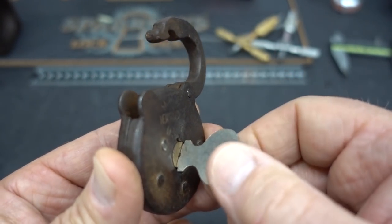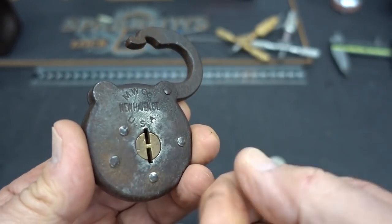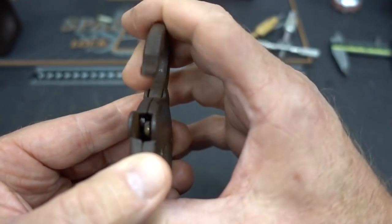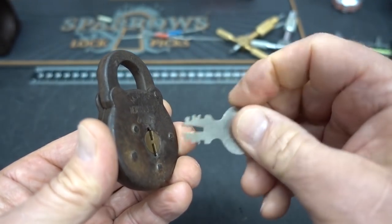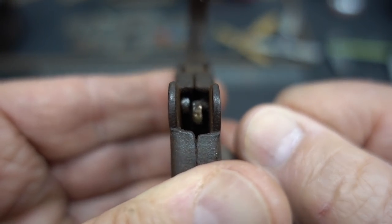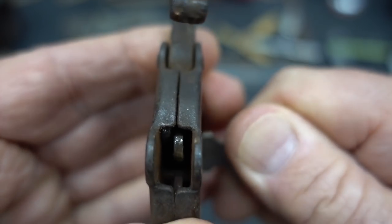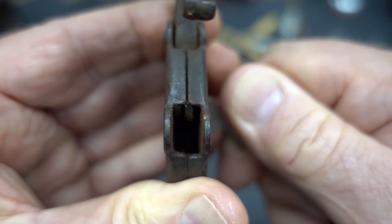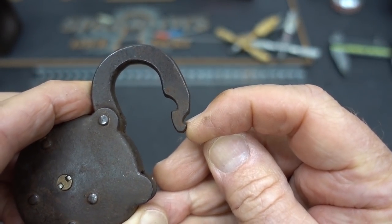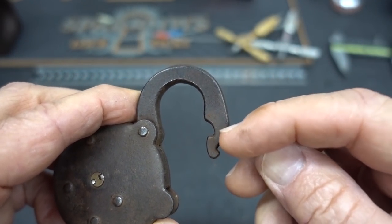So it's kind of weird. And here's another weird thing. Unlike most lever locks, which require the key in order to lock it, this one looks like it has spring-loaded locking jaws. So there's your locking bars — looks like one on that side and three on that side. You can see it pulling over, so it's actually grabbing from both sides. One is locking into that cut, and the other is locking into the other cut. Notice how much further down that one is.